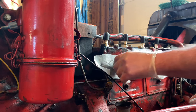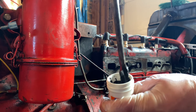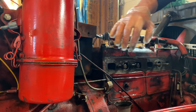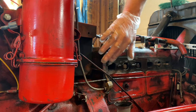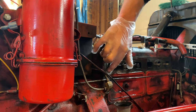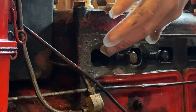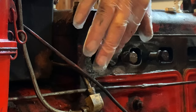We'll take the wax paper back off and start to apply our liquid steel. I just opened this up here and it looks like it kind of all solidified to one end sitting on the shelf, so I'm going through with a screwdriver and mixing it up. I put some rubber gloves on — I don't really know what all is in this particular product, and much like most products we use, it does say that according to the state of California it will cause cancer. I'm just going to smear this around number four and then get our wax paper on there. The set time on this stuff is pretty fast — five minutes — and the cure time is about an hour.